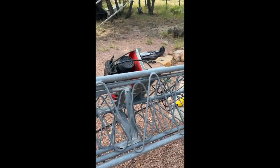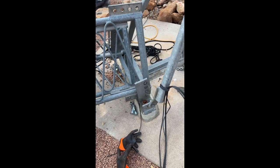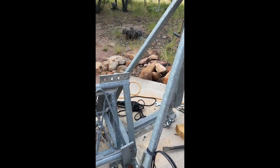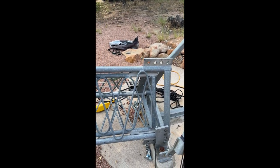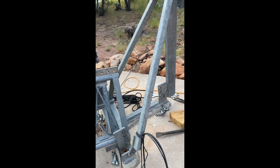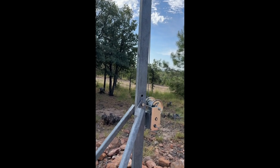I'm really careful when I crank the thing up and tilt it, because the whole thing is now based on two bolts down to the bottom. If one of those was to break, the tower's going to go that way. I keep my feet as far outside of that triangle as I can, because if it snaps I'd be upset — but I'd be more upset if I had to go to the hospital.